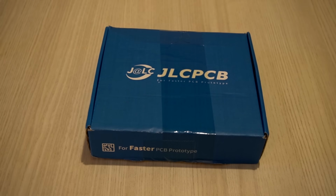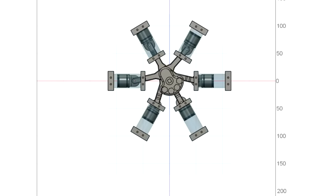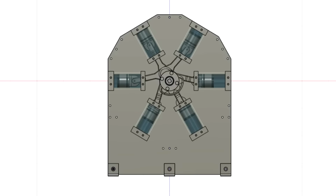Let's get back to the stage thing. There will be 2 sets of 3, where 2 pistons pump air into one. A single piston was able to increase the pressure to 40 psi. So by using this method, we should be doubling that. And since we have 2 sets of this setup, the speed will also increase.